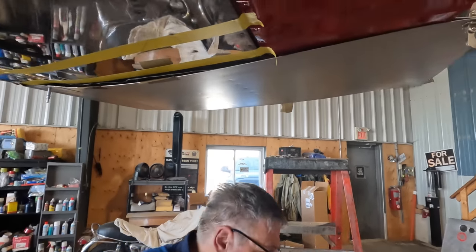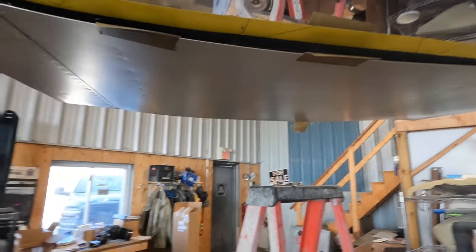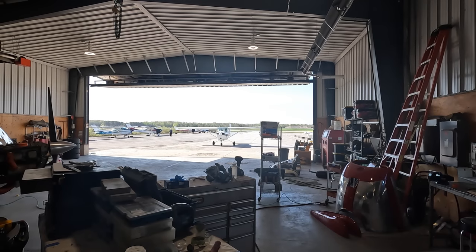And the top skin has shifted ever so slightly from the bottom skin. So the hole isn't round. And you can see where leaving that rivet in would have hampered the ability to shape the leading edge and fit the new extension to the wing. Subtle little things that you learn from the master installer.